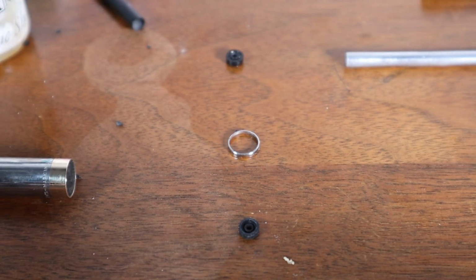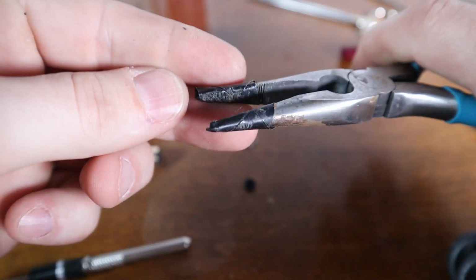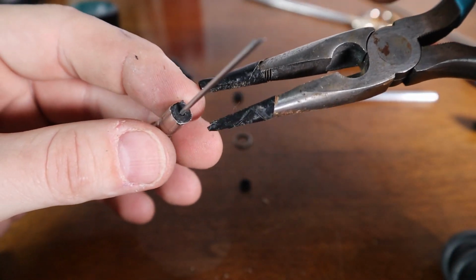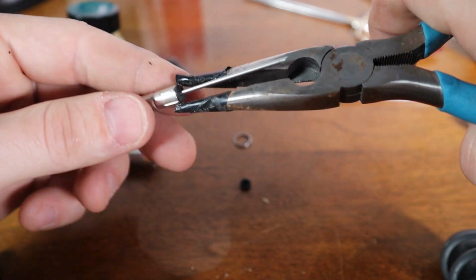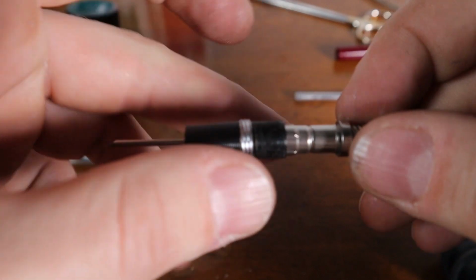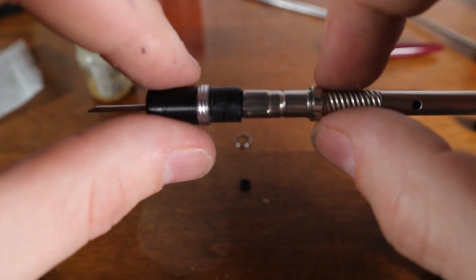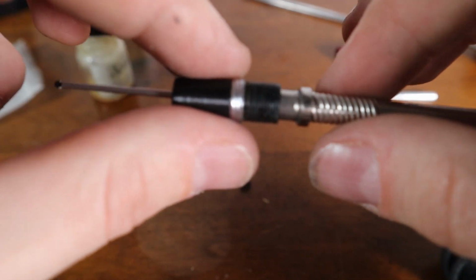Okay, I'm back again. Let me show you the pliers I used. This is just a pair of little needle-nose pliers, and I had put some electrical tape on the tips just to make them softer, and all I really did was take it and orient it so that I'm squeezing in between those little raised areas, just a little bit of a squeeze, and I worked it around a few times just to get to it, and I would check myself with this. If you remember, it had a little bit of a rub, and it took me some pressure, but now it's rubbing because it's just touching it, of course, but super easy, super smooth, and I can rotate it, get them down in different tracks, very smooth.